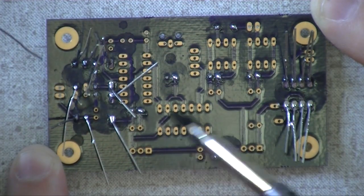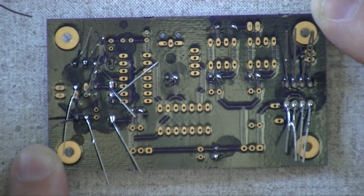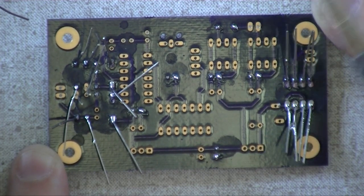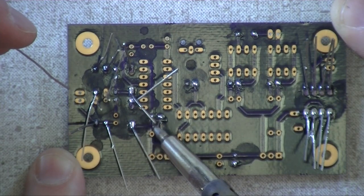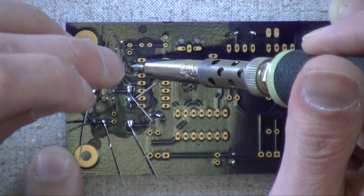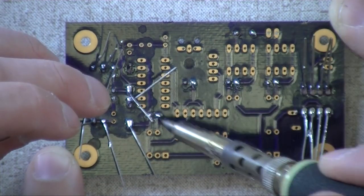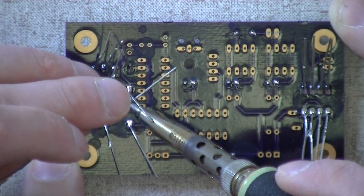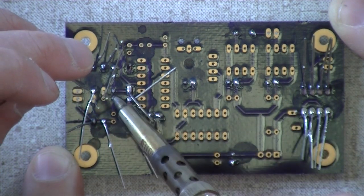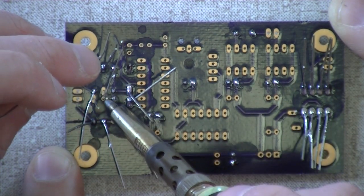I thought you did a solder bridge there. Well, I did do a solder bridge, but it's way out here on the end of the lead, and I'm going to cut that off anyway, so it doesn't matter. You got a couple of pads over there that need a little more solder. I'm going to get in here and heat that up a little bit. When you heat it up, you can see the solder just reflow around the part. And then it's cool. Well, actually, then it's rather warm, but... Don't start with me, young man. Okay.